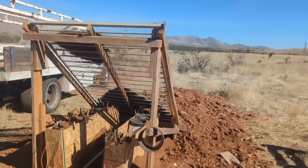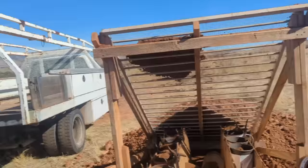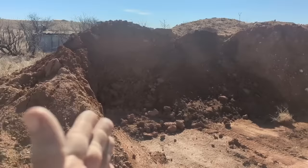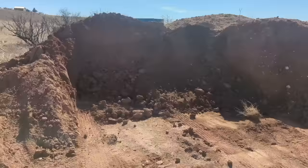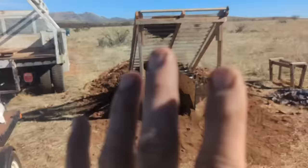This won't work if you're adding concrete to your dirt or doing Hyper Adobe or Super Adobe, because with those methods you add water and mix it. The reason they do it that way is they tamp that dirt down to form their walls, and those walls are going to be load bearing — they'll put the beams for the roof on top. So if you're having a load-bearing wall, you want that dirt pretty stabilized. Also, they'll apply cob to the outside of the walls, and if the walls aren't stabilized, that cob is going to constantly crack as the walls settle.